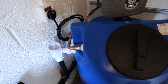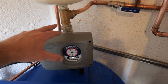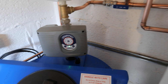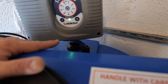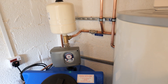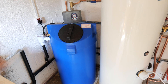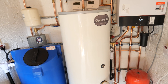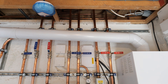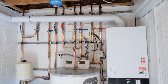The overflow waste pipe size is 32mm, you've got your standard 15mm for your fill valve, and it comes pretty much assembled — all you really have to do is get the T on, get the expansion vessel on, and then pipe it up. One thing to bear in mind when you first turn it on: I had an airlock in it and I had to crack the bottom nut to bleed the air out. As soon as that happened you could hear it straight away — the pump kicked in and pressure went to all the taps. Really nice bit of kit — really powerful, almost too powerful. So yeah, 200-litre slimline version to match the cylinder. Everything is now up and running. Regarding the rest of this job, I'm going to be running pipework, getting all the central heating done, chasing pipes into the walls, and hopefully taking care of all the bathrooms for this customer. Thank you very much for watching — hopefully catch you on the next one.